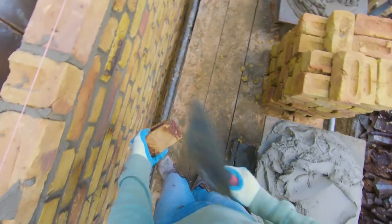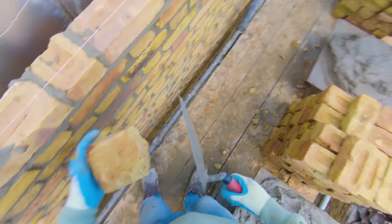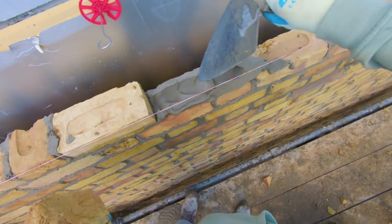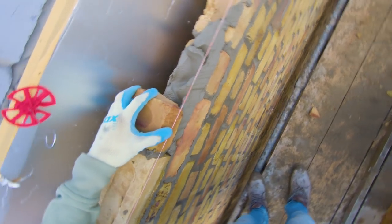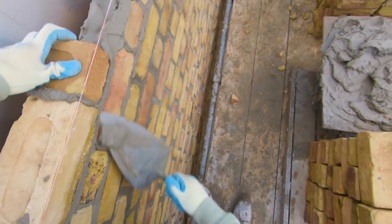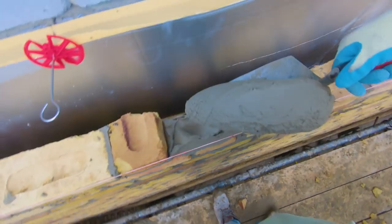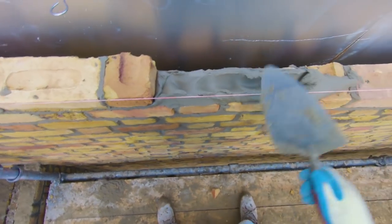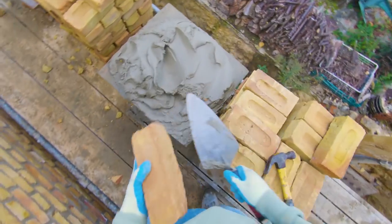Now I'm going to cut these with the trowel — that's what that scutch hammer was for, the one I showed you earlier. But honestly, the only thing I'll use is a trowel and a hammer when I run a line. That one is floating over a bit, but I'll get it back because I know there's a perp up there that needs it. 'Floating over' means when you're putting a brick down and your perp is slightly past the line — you're floating over the line.